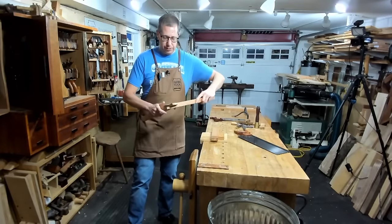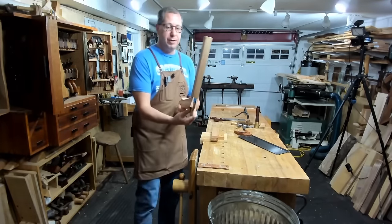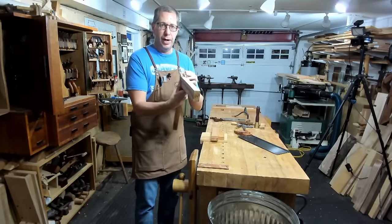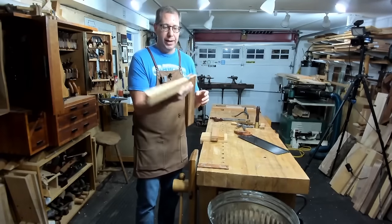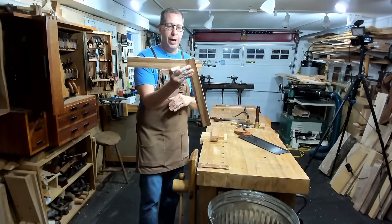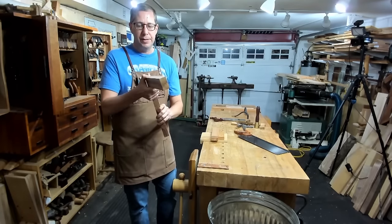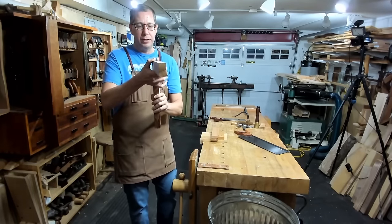What this is — I've got an angle here, but then I also have an angle in this direction. This would be very typical of the joint of the back leg of a chair, where this is the rail. The chair forms kind of a trapezoid shape; the rails splay out so the front is wider than the back. The back legs may also angle back from the floor rail. A lot of times you'll also find twist in this direction, which I talk about in semester four with compound angle tenons.